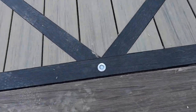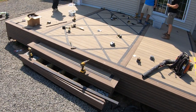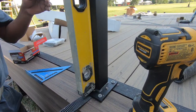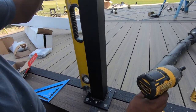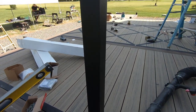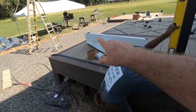Can't wait to get this all lit up — this is gonna look awesome! Now that we've got the stairs done we are on to the railing. Once again we're using the Decorators ALX Contemporary Rail System — my favorite railing by far. We cut down the tops because we're gonna have a cocktail rail here like we always do. This is a super easy system because it just gets top mounted. Make sure you have blocking underneath, which we do, and these just get lagged down. You would not believe how strong this is.